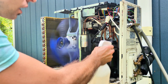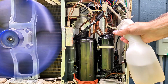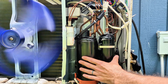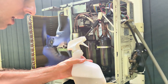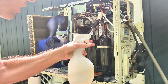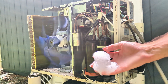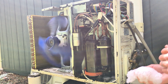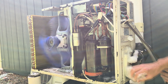I'm going to do all the connections inside as well. The hum from the compressor just stopped — on mine, the compressor ran for about five minutes. The soapy water spray using dish liquid didn't get bubbly enough for me to see everywhere, so I got a different solution: some typical bubble bath bubbles. These will really stick just about anywhere and stay there. So with the compressor running again, I'm just going to add these bubbles everywhere — this will work really well.